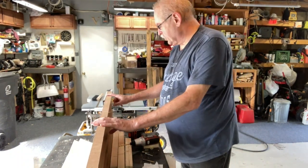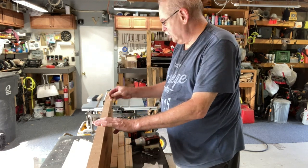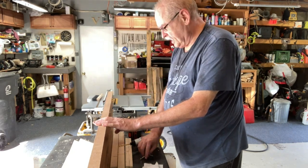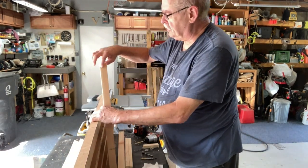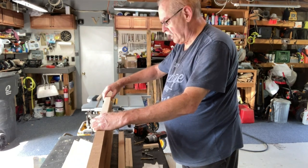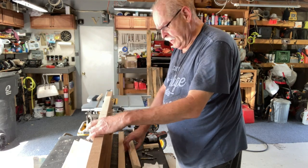Okay, so I did drill the holes. 3/16 drill inside the table or the ramp, that's for the threads. And then a quarter inch clearance hole into the legs. The leg hole's a little bit offset here, so when the leg gets folded up, it lines up with that hole, and this will be flush, so when it folds up, it'll be relatively flat.